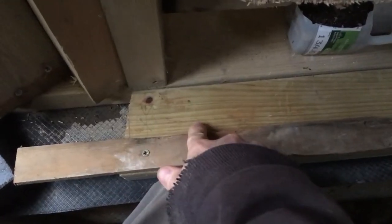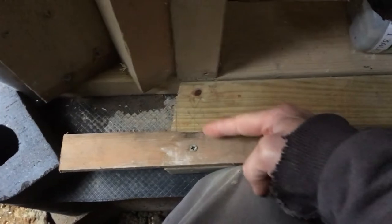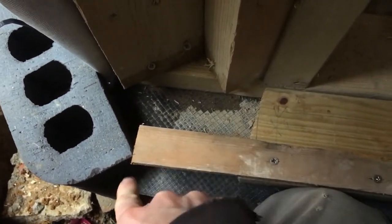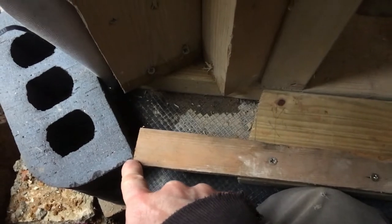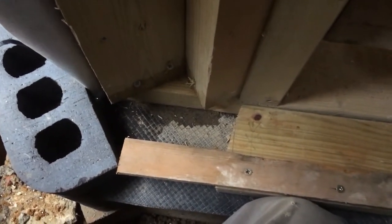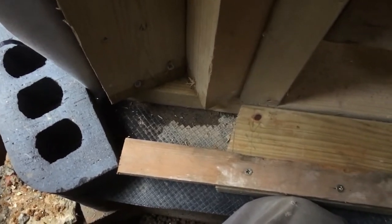This little jig represents 100mm of hempcrete which joins the brick column around about there. I've got a little mark there showing the corner. So if I project that up to the top I can check the placement of the column. And that is pretty good, so I can go ahead and fix it.